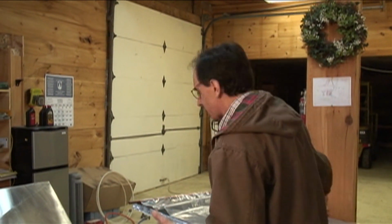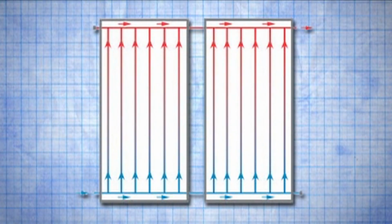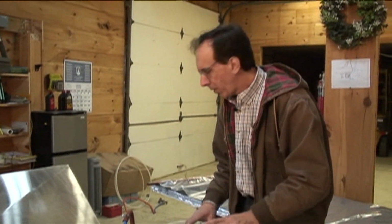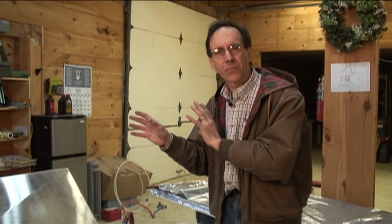And we can use that kind of a system as a drain back system where we pump water up to the roof and through the collector. In this case, it would trickle down the collector, but it could be a fin tube collector where we fill the tubes pumping upwards. Either way, we heat the water and it comes back down. All the pipes in that system drain back to this tank by gravity. And by doing that, when the pump shuts off, all the water drains back into the tank, rendering everything freeze safe.